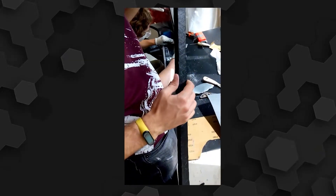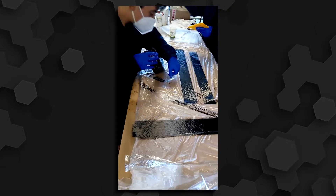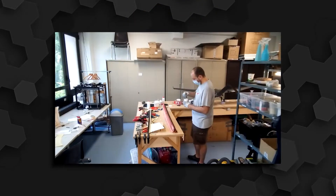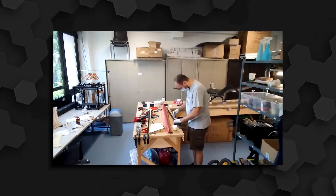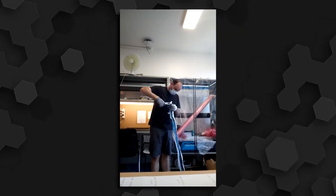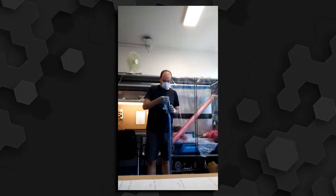The main problems emerged during the production of the C-shaped spars. We had to iterate through various approaches to obtain a standard production method that was able to ensure repeatable results with an acceptable geometry. In the end, we opted for a set of negative moulds used to laminate the exterior of the spars that are filled with an internal foam core provided by one of our sponsors.